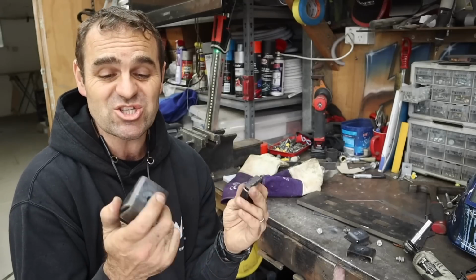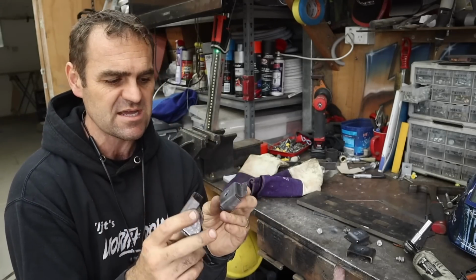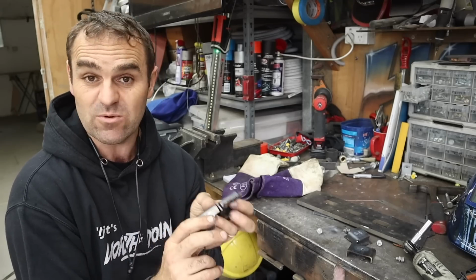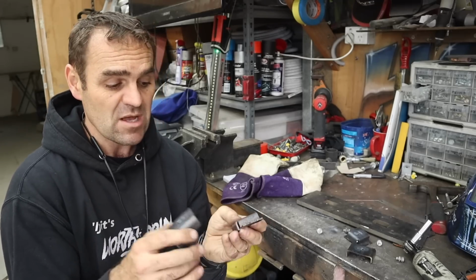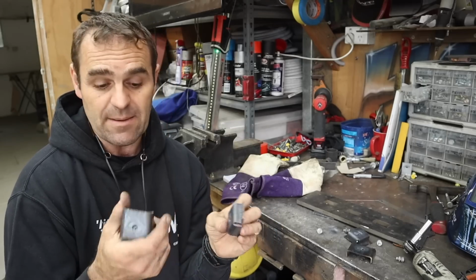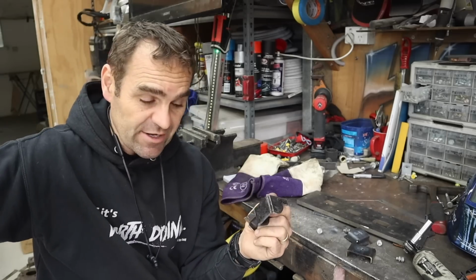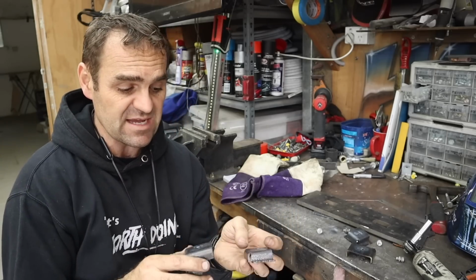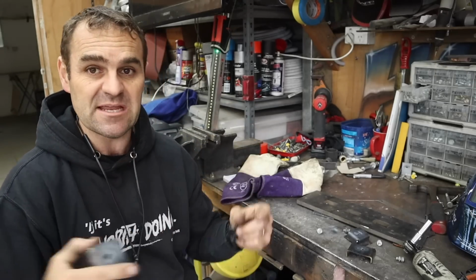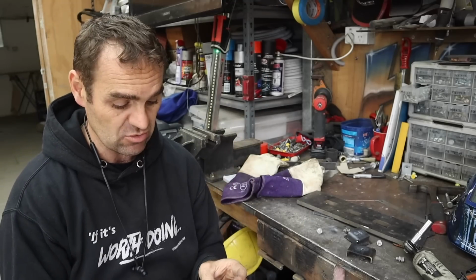All right, so I just spent a bunch of time building up some nice, big, heavy, chunky seat brackets. They're much heavier duty than the original ones, which is good, because obviously you want some safety. And I've welded in some captive nuts into them. The plan now is to paint some weld-through primer on the back, clean up inside the floor where I'm going to weld them up, and then I'll bolt these to the seat and tack them in while they're attached to the seat so that I make sure they're in the exact right spot. So let's do that.